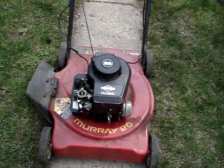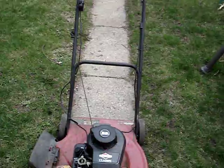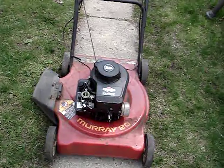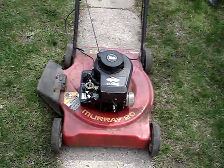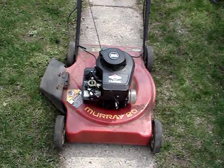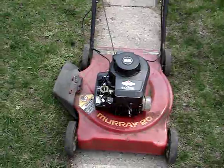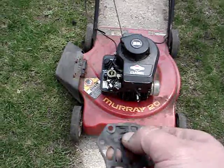It's in nice shape. It's the exact same mower featured on the David's Farm videos. I was watching part 2 of Dave's videos and I learned something. He was saying it would start revving up and down and going putt putt putt and putting black smoke out of the exhaust when the diaphragm is bad. He said the diaphragm forms a little wrinkle in it — and here's the old diaphragm. There's the wrinkle right there.